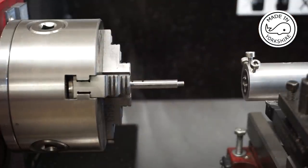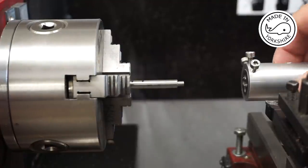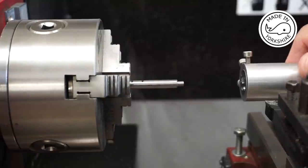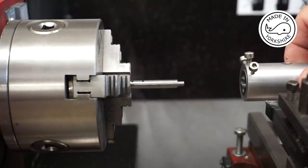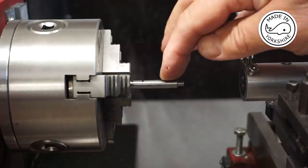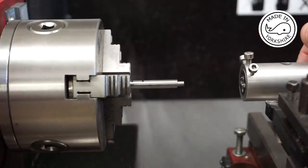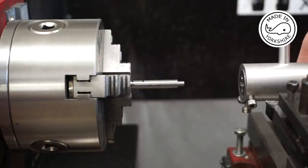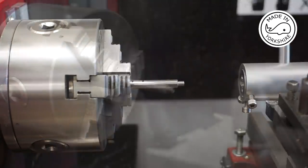and I was hoping to do this using the lathe, but I think my lathe can only do a maximum of 20 TPI, so hey ho, I'm going to have to use a die. Now, it is a high speed steel die, but I have concerns that whether it's capable of actually cutting all this thread, but we'll give it a try. I'll have a go off camera because it's a bit tight, and then I'll get back to you.